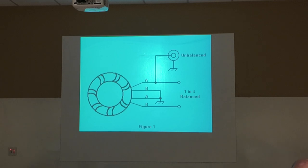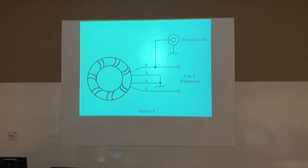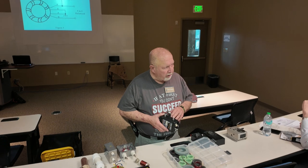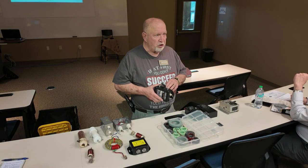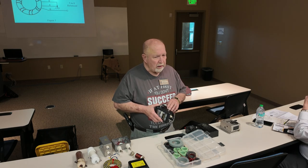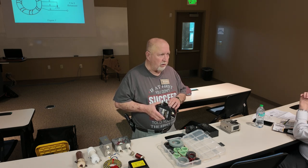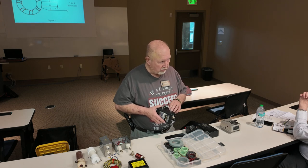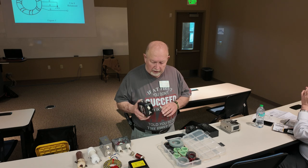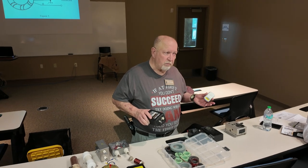I've got two of these running. One of them runs 140 foot wire, and the other one runs a 260 foot wire. Okay. They are grounded, but they're grounded to, I'm on the second story, so down and around probably 25 feet, 30 feet of ground wire. Well, a long ground wire is bad. There's too much resistance in it, and RF and all that stuff is going to go to the point of least resistance. So in this case, it goes out on the coax right here, on the shield of the coax, which causes RF in my shack.